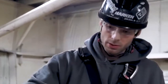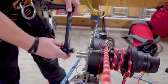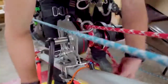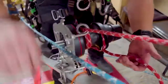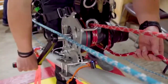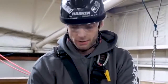For manual operation using the crank, it's a locking crank. This mechanism will lock into the hub of the device so you don't have to worry about any dropped item risk. Going clockwise puts you in the higher speed, lower torque mode — roughly 13 to 1 mechanical advantage — which is going forward. Going counterclockwise is where you implement the 40 to 1 mechanical advantage: lower speed, higher torque.